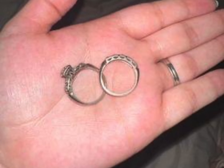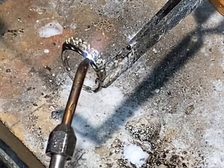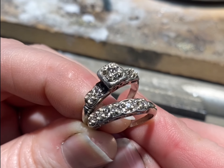We put a small ball of metal on top of each prong that's worn down, which is all of them. In this case we did 32 tips. At this stage I'm not really worried about exactly how well they look — I just want to get some metal on top and I'll clean them up and make them all uniform in the next step. This took quite a while, so I've sped it up quite a bit. I'm adding one little ball of metal on the top of each prong, and this is what it looks like when they're all in place.